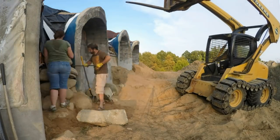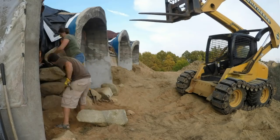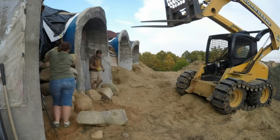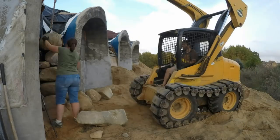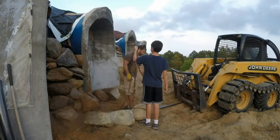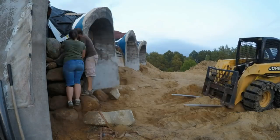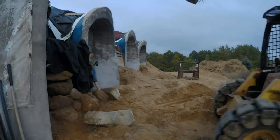The first rule of boulder wall building is to build it as if it's already fallen down. So we inclined the wall so it was falling back against the earth and we kept filling up behind it. We also had landscaper's fabric behind the wall and would put down a layer with the excess flopped forward over the wall, then backfill behind the wall until we were up near the wall height, then flip that landscaper's fabric back over the dirt and add more boulders.